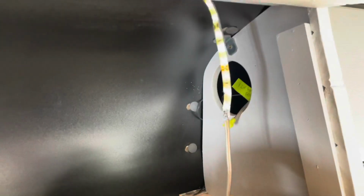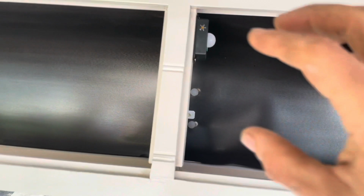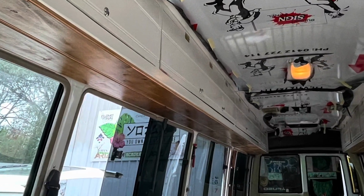Or you can opt for the switch, which I'll make a little thing for. And you'll see when I flip the switch, the lights get brighter. Which is kind of cool, because I mean, it's a really long LED strip that goes all the way down, and so the power source for the automated light is coming from this side. Has to go all the way around before it gets to here, whereas the power from the switch comes from there. So it's much shorter run, and just shows here how much voltage you can lose in the long run. So we've got a few different options there. It's really cool. Now let me show it all off with some slow moving pictures.